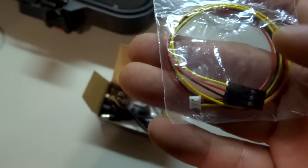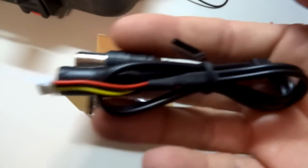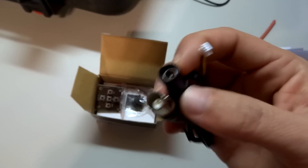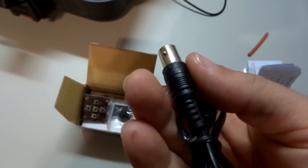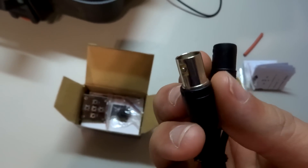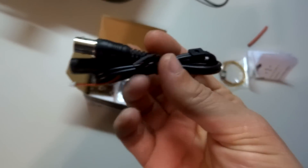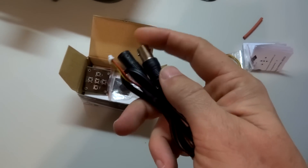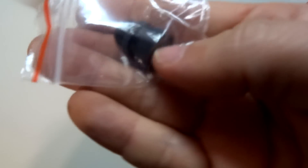There was also a short pigtail cable with a small white connector and bare wires on the other end, which I used to mount it into my airplane. This video cable included with most security cameras has a 12 volt barrel connector for power. This is a BNC video connector. I recommend picking up an adapter if you're going to buy a few of these cameras — it's good to use the included cables to test cameras on the bench, but this BNC connector won't mate with the other gear. Pick those adapters up for a few dollars.